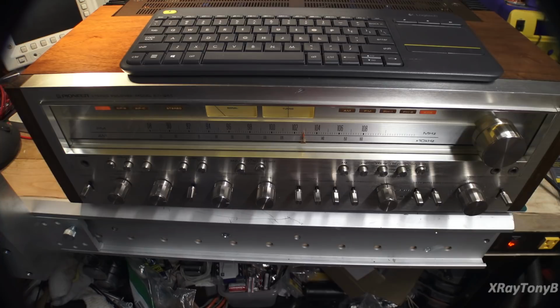And as you saw with the earlier test, even putting out 100 millivolts RMS to the speakers, there was absolutely no crossover distortion, nothing. So this is a very, very clean amp. I'm really anxious to hear the phono stage on this, and I'm kind of halfway thinking maybe I want to set up a turntable and listen to it at least a little bit. But this is it. Here it is.